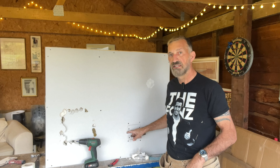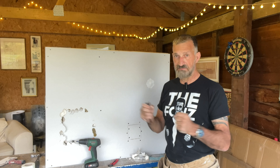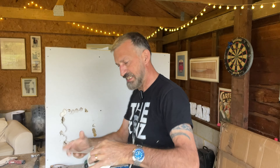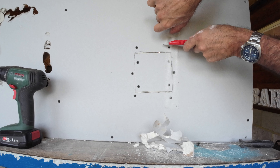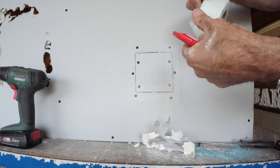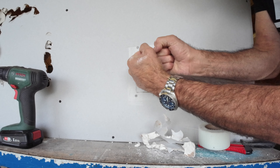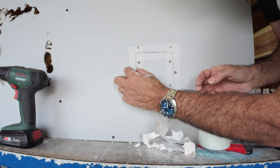Now, because we've got timber and plasterboard together, they have different thermal properties. Timber will expand and contract; plasterboard is fairly inert and won't. So if your timber starts expanding and contracting in summer and winter, it'll put stress on the joint and you'll have cracks. So what do we use? Scrim tape. Scrim tape is a mesh and it's slightly sticky. Just hold it in place, stick it down, and then Stanley knife across the top. It doesn't have to be perfect as long as it's covering the joint. This mesh has a real high tensile strength, so if this tries to pull apart, it won't allow it.